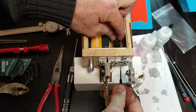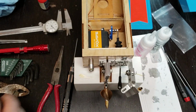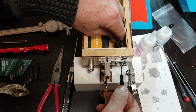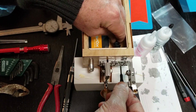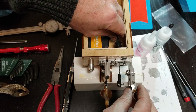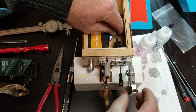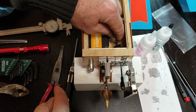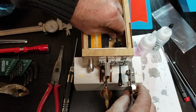I have the servo centered up and all those screws are Loctited on. So then I'll center this rubber boot. Just want it where, with the boot relaxed, the rudder is centered. About like so, so the boot contracts and expands equally, and it'll stay there.